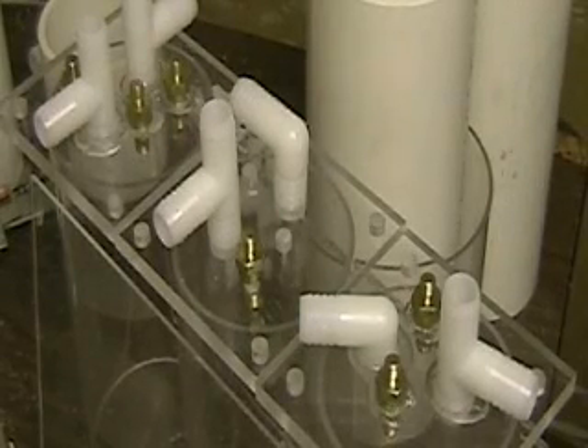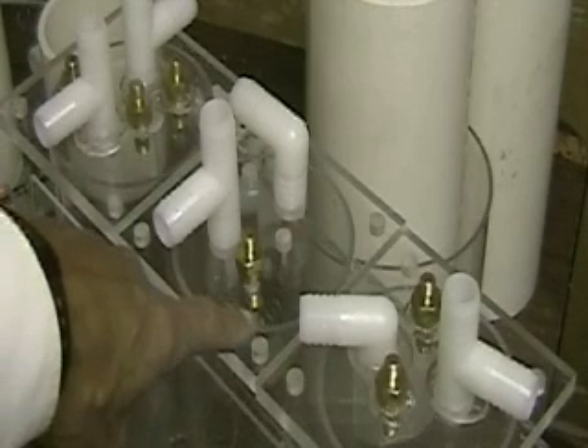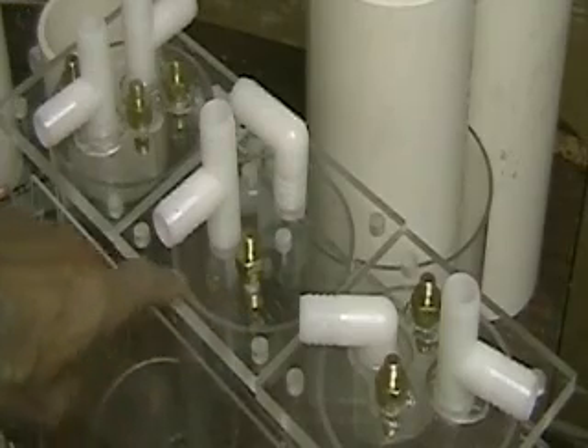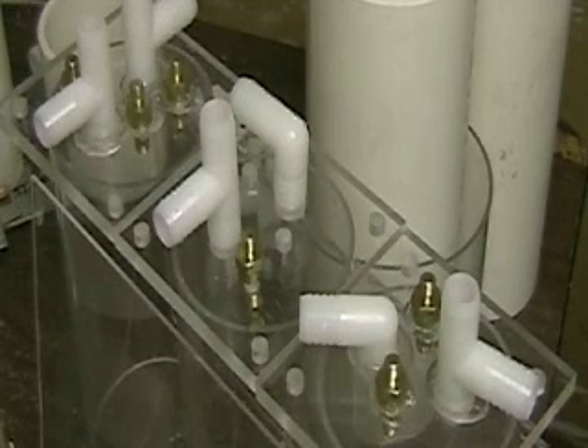This is Hydrogen Tap. What you're looking at here is the latest in the hydrogen cell designs that I've put together, and I'll be showing in the next four or five days. The system itself has six units — you're looking at three here. Each one of these contains 15 plates, eight by three inches. All the cells are surrounded by water, which is a cooling device, and each cell itself is connected together. So there's six of these cells together as one that makes up one unit, which I call the Liberty.